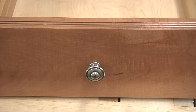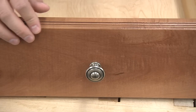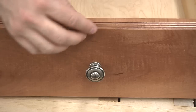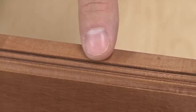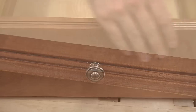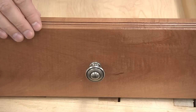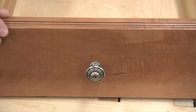The wood on the cabinet is definitely maple, and the color is just a medium brown. But look at these darker areas in the nooks and crannies — that's a glaze. A lot of cabinet companies will put a base color on, then some finish, then use a glaze to darken and create shadow lines, giving it a bit of an aged look. So we'll need to try to replicate that with our frame.